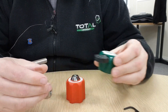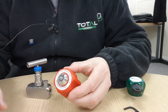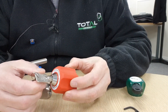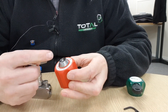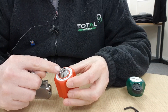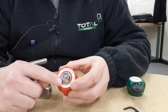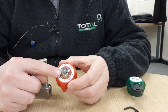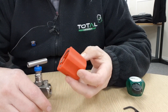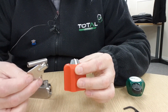So with that requirement in mind we set about developing a new lock, which you can see here. This one uses what they call a radial pin tumbler mechanical key lock, and the nature of this design is that the number of unique key permutations is very, very high — running into the tens of thousands — so the potential for having many of these locks on site all opening with a unique key is now good.